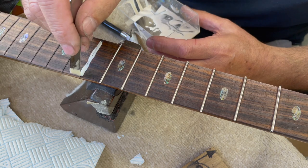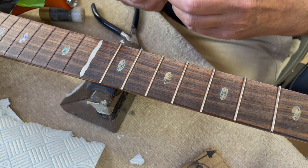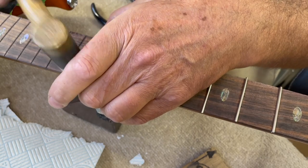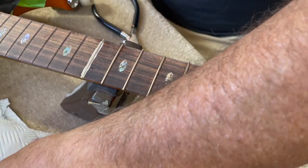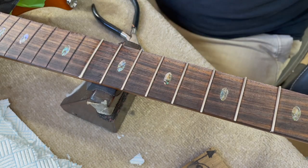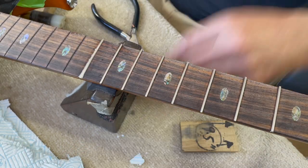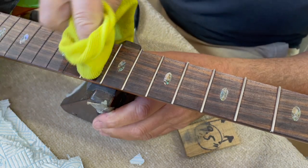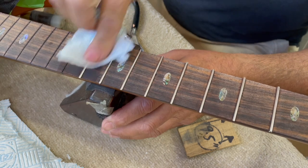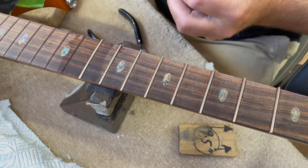As far as I know, the GS2 neck was pretty thin in terms of finish, so I don't want to make it too much different from the original if I can help it. It has got a bit of colour in it, so I needed to get some tinted poly on there first, and then go over with some matte. It was a bit tricky because you make up tinted poly and you have to decide how tinted it is, and do you go with a full dark looking thing, which might look good on this one guitar but might really not suit the build up of finish on the other guitar I'm doing. So I have to try and get a midpoint, and it might mean that I end up with a couple more coats on the GS2 than I perhaps would have liked.